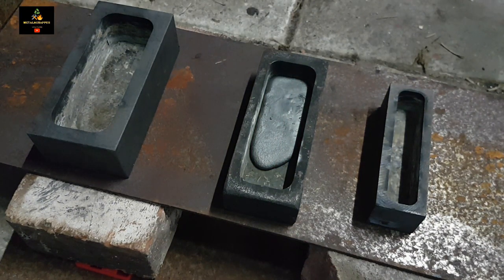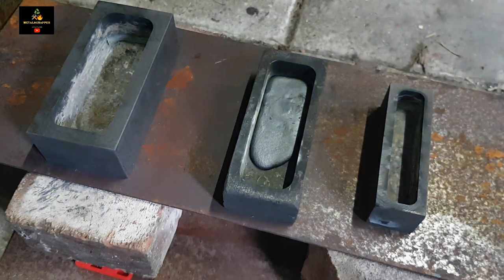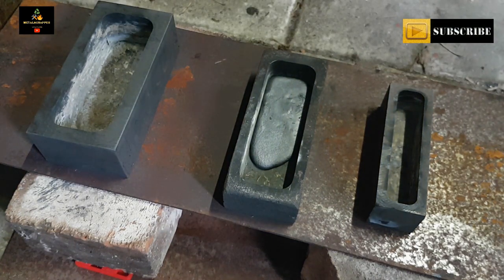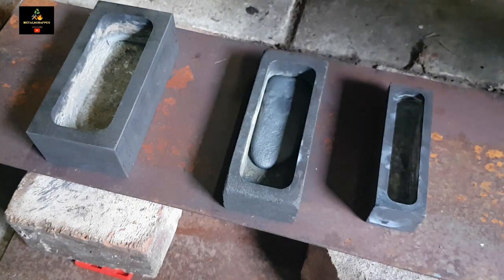So this took me 21 minutes before all the remaining copper, it looks like copper this time, has been melted. So it took a while. I turned it up to 1200 degrees Celsius, and I think this is real copper. We have to check that. So let's get it out. Grab my channel locks. And I will now let the crucible cool a little bit down, so I can fill it up with the copper, and we'll start off with melting the other copper.